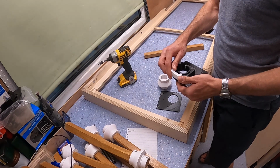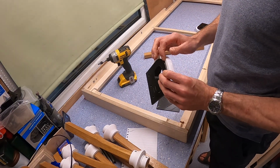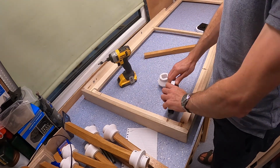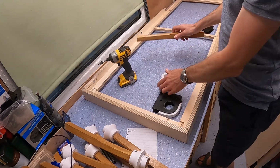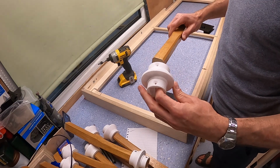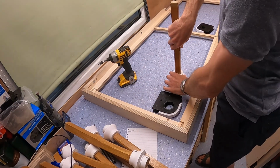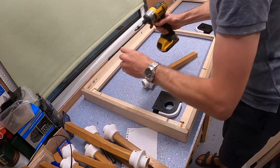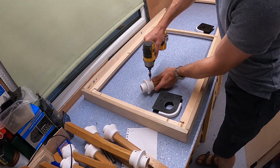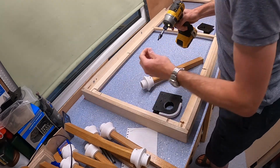This fits together like this. So this piece, this outrigger, goes in here because it gives a nice clean finish when you print it. That bit goes on that side, like that. And then this, the leg, goes into this separate model here. I put screw holes in there so it fits nicely on the end. Put a couple of, what are these, 4mm by 4mm screws. You just need to torque them up a little bit so that it doesn't slip.